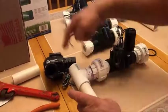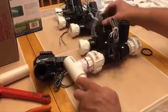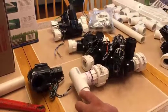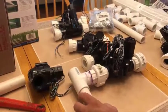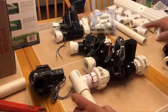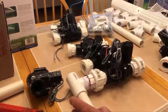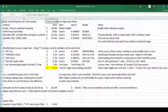These will eventually be glued in for your main line in succession for one zone, two zones, three zones. I'm actually going to separate mine out — I'll have a three-zone and another three-zone, and you can just daisy chain the main line out. But these are the ones that are actually supplying the water to your zones within your irrigation system.